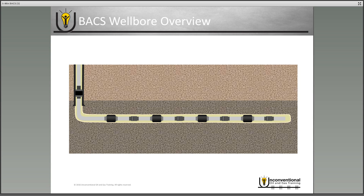We'll start with our horizontal well diagram. Our well is already drilled, our completion system is in the well, and there are two primary components to this type of system: your open hole packer, which provides isolation, and your ball activated frac sleeves, which will divert your frac fluid to each individual section of the well.